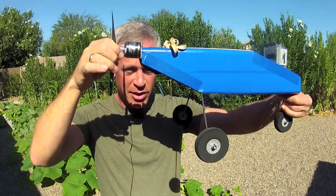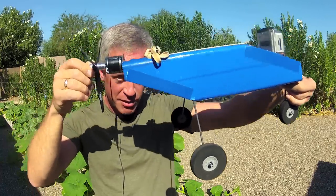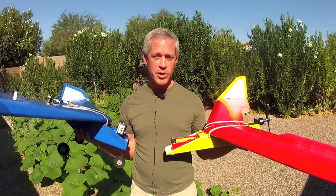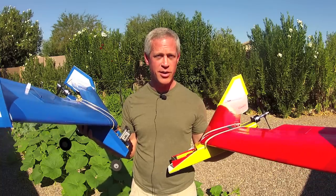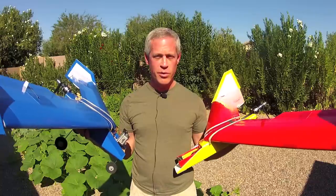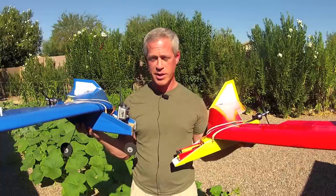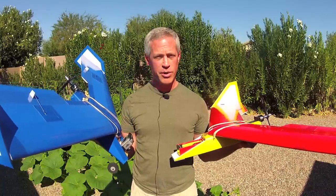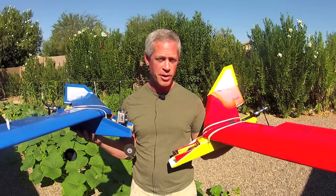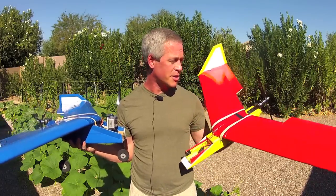The smaller prop still obtains good ground clearance upon rotation and flare for landing without needing overly long main gear. So far, this plane has turned out to be truly compact as intended, and when properly trimmed it's a joy to fly — very responsive, easy to take off and land, with no terrible characteristics. Being a flying wing, they do require pretty aggressive control throws on the elevons. An improperly balanced plane with a CG too far forward requires a lot of increased reflex to be trimmed in, which detracts from flight efficiency, so it's important to get it trimmed properly. Fortunately, having the fixed CG on the wing allows you to move the fuselage fore and aft as needed to accomplish that proper CG.